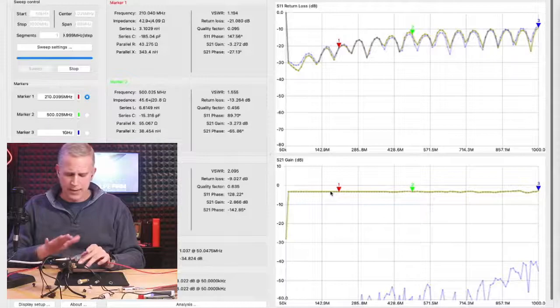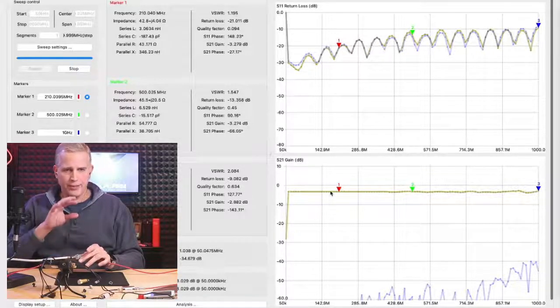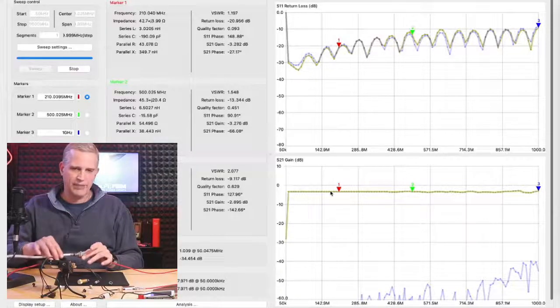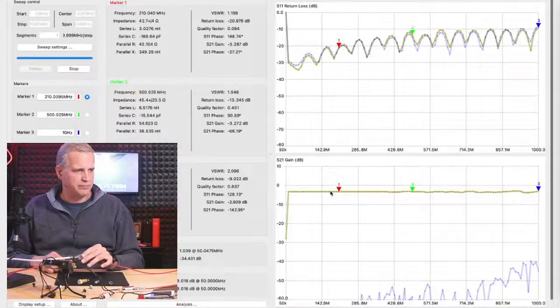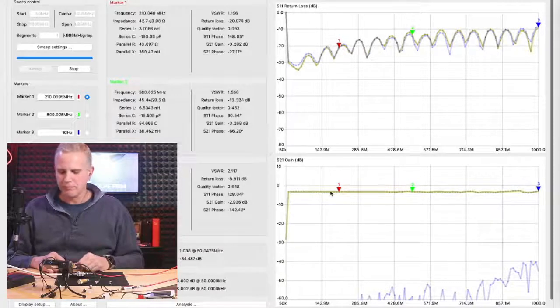And this, by the way, is typically the best setup going into any subscriber's home where you have a two-way splitter, one leg feeding the cable modem, one leg feeding the rest of the house. I'm pleasantly surprised. Actually, it's about 3.5 dB of loss across the whole band. That's a good splitter. Some of them can be 5 dB of loss at 1 gig sometimes.